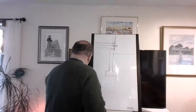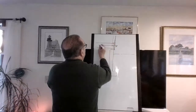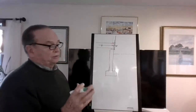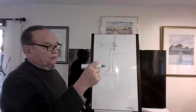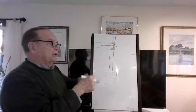You need a shutoff inside, even with this frost free. So inside the cellar, you're going to have a shutoff, right? With the handle usually so it's accessible straight down or at least on the side. This valve has a little screw on the end of it, maybe about a 1/4 inch, and you loosen it and the water comes out.